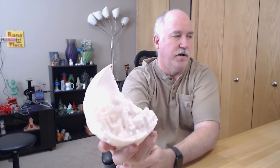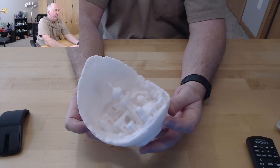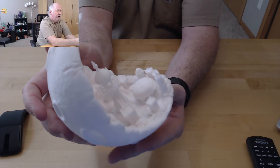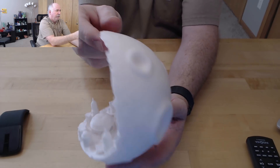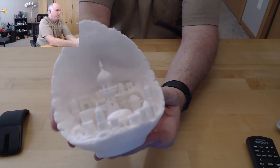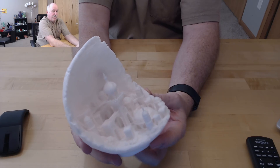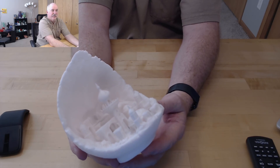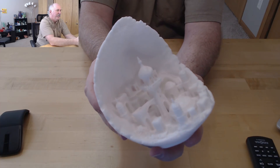So this is what I ended up printing — the Moon City by Juca. I apologize, I'll put the full name in the description below, but I found it on MyMiniFactory. This was printed at 0.15, which is the default optimal print setting in Slic3r Prusa Edition. The filament is generic white filament — bulk filament, really cheap, like seven dollars a roll. I wanted to see what it was going to be like and it's been printing really well. I kind of wish I would have bought more.